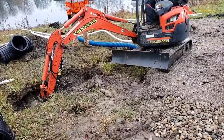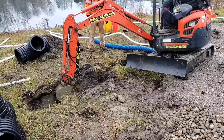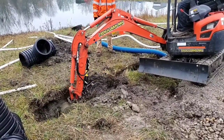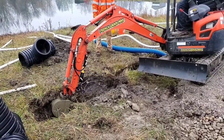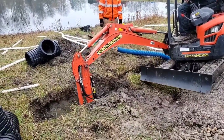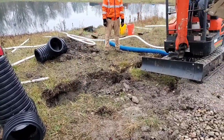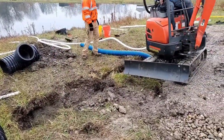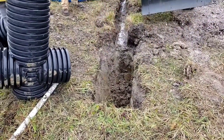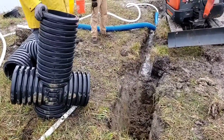What happens when you go too shallow? You're backfeeding water into your whole drainage system. If you're in the north, that's going to freeze up on you. If you're in the south, well, during the drought season, the trees and shrubs are going to fill your French drain system, yard drain system, whatever it is that's holding water, the roots are going to fill. All right, we're getting pretty deep here. This is pretty cool. I got a 36-inch outdoor sump pump system housing that we're going to drop in.